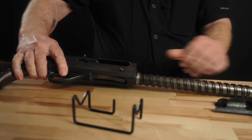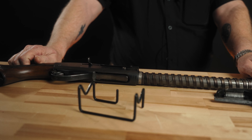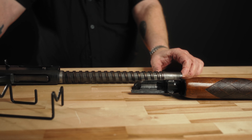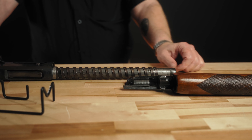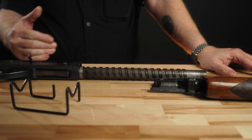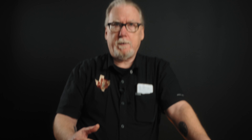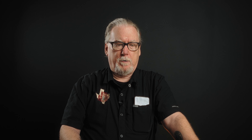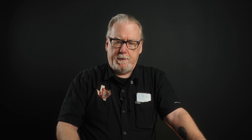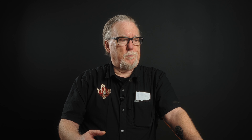I've done it on quite a few Sportsman versions before. I've always used a mandrel to push through and raise those little indentations, and then it's just a regular 1148 magazine tube. Replacing the magazine tube on these guns isn't normally done outside a factory setting — they're brazed in — but they can be removed. I've seen them drilled out. Sportsman is really more of a line for Remington than a model. The Remington 11, the older gun, was also available as a Sportsman with the same blocked magazine tube. The Sportsman 48 was available in the other grades as well.